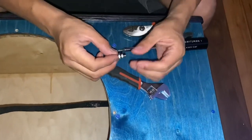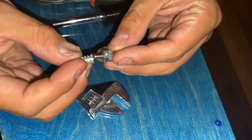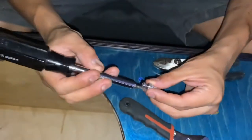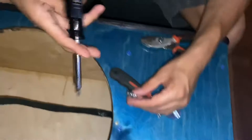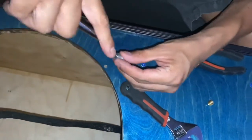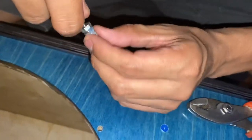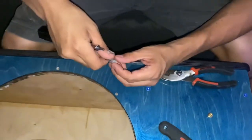There's a workaround so you don't actually have to buy the special tool — just use two nuts and tighten them together. Make sure there's enough room so you can put your insert in. Put a little bit of glue beforehand, then drive it in. Once you've squeezed it in flush, just unscrew it and you'll be able to pry it out at that point.